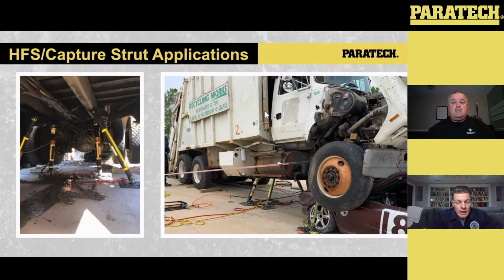for our capture. And like I said, I'll talk about whether we want to lift from the bottom or we want to go to the outside of the vehicle. There's pros and cons to each. We found that we like to keep it relatively low because we're maximizing the capacity of those pieces of equipment. Axles, when you're doing heavy vehicle lifting, axles are going to be your best bet every time. And those contour bases, the multi-bases are good, but the contour bases, there's so much surface contact and bite with those things that they marry up perfectly to those channels that are running back and forth.